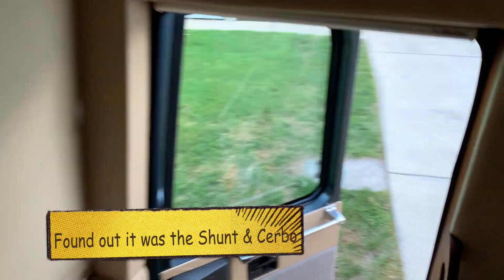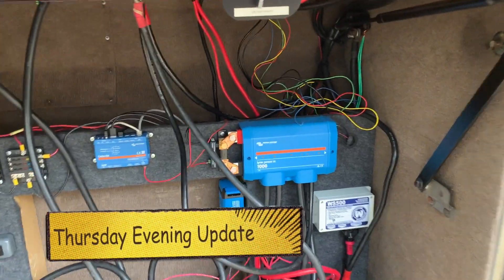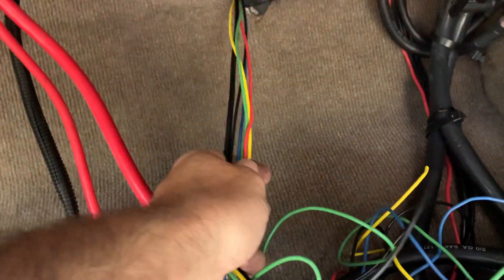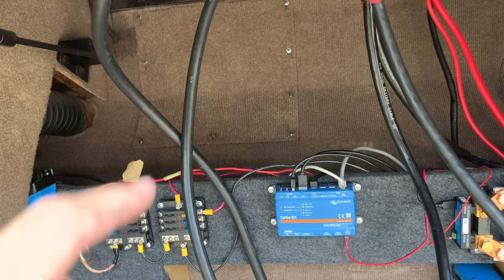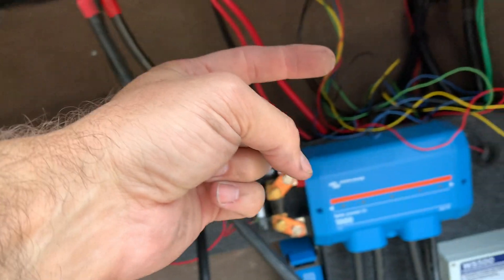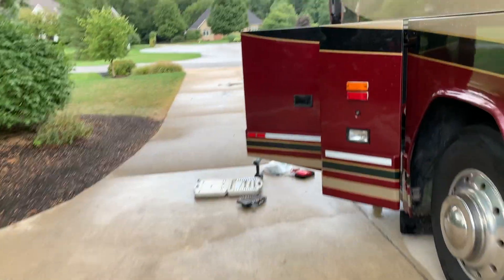What we're doing right now is pulling wire for the WakeSpeed. I've got a mess here of automotive wire, a fish tape, and I removed this cover — it's open to the fuel tank. Basically there's a conduit in here that runs all the way to the back, so I put a fish tape through and then pulled these wires along with the sense wire all the way back.